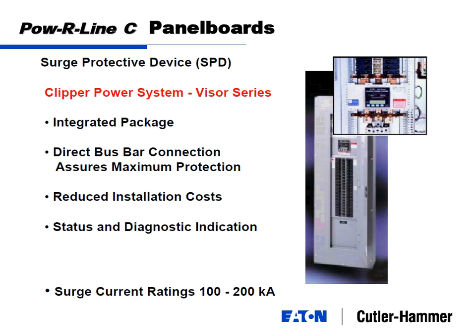If you were going to side mount it, you basically put a 30 amp three pole breaker, and then connect these wires to the three pole breaker, and mount it in a can, say right next to the panel. When you do that, this will still look at your A, B, and C bus, but rather than chopping it off at a lower let-through voltage, it'll basically double it.